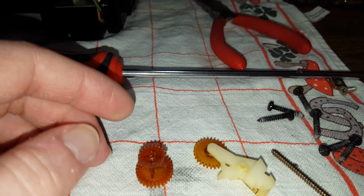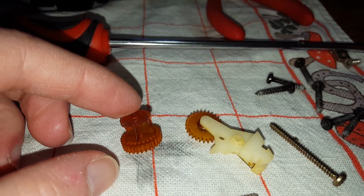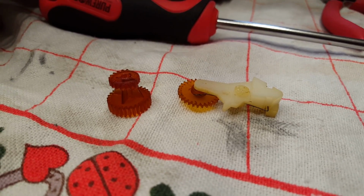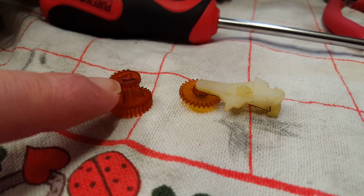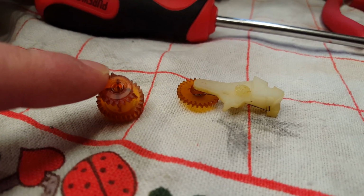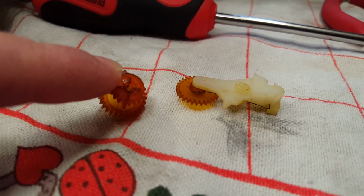AG3304 here on YouTube, refers to as the red Leicester cheese gears. And indeed, these gears are made from a very soft material. This sandwich gear, the upper gear transfers the motion coming from the worm gear, and that's where the problem is. As you can see, half of the teeth are missing.